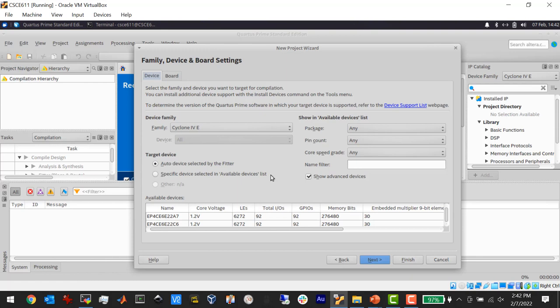Here's the part that's a little obnoxious. There are a gazillion different FPGAs out there — a shocking amount. You have to set up not only the specific FPGA, but what package it's in and the speed grade. You can have the same FPGA in multiple packages, which is true for any chip. Some FPGAs that come off the fab can run faster than others — those are given a higher speed grade.